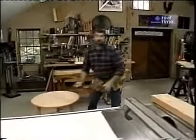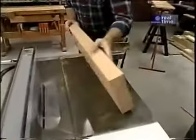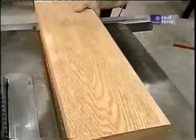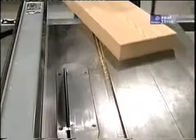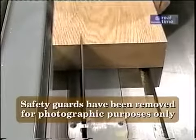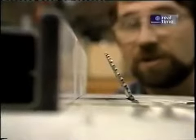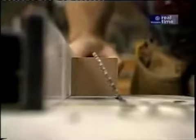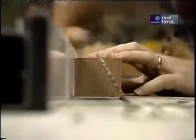Now, to make the legs, I picked up a piece of oak at my hardwood outlet that's about 2.5 inches thick. The first thing I want to do is rip 3 strips 2 inches wide. Okay, now with my saw blade tilted to a 30-degree angle and my rip fence moved over so that I'll get 2¼ inches to the long point, I'm going to rip each piece, and that'll give me the sharp angle, or the outside of the corner of the leg.